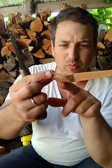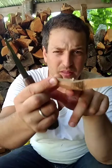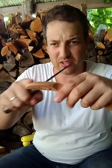The deepest point of the spoon bowl should be basically mirroring the deepest part of the rim. You can see the deepest part of the rim is right here, and the deepest part of the spoon bowl is here — so that's the point from which all cuts flow away from on the back. This is the area where a lot of people do the chicken wing cut, but I find the thumb push gives me a lot better control of what I'm actually cutting.